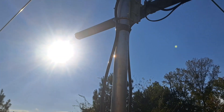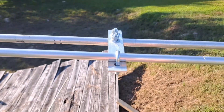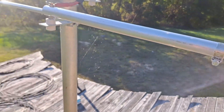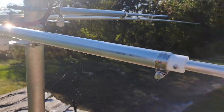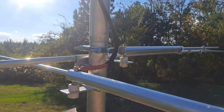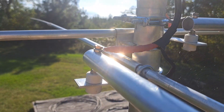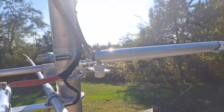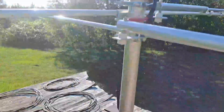I kept the coax separated up that pole, a little side by side — that's pretty much how that works. So I hope that helps everybody. You can see how I mounted the slide — this is the beam, this is the gamma match, and that's how it's mounted for the conductor bracket. Heat shrink and solder all that stuff really well. Heat shrink the gray or nylon parts so the sun doesn't get to them, soldered it to the center conductor so it's optimally connected, same thing with the shield and on the other side as well. After that it's all wrapped. Thank you for tuning in — hit that like, subscribe, and share.